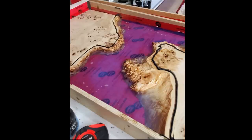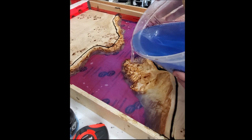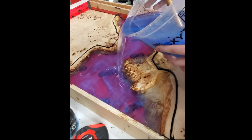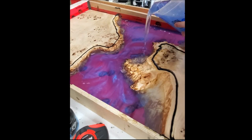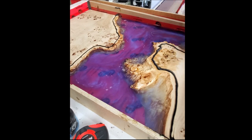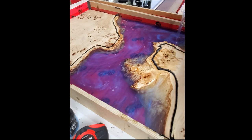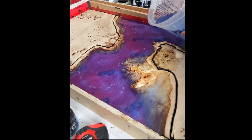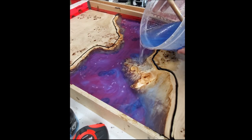The total volume of this pour was nine liters total — six liters in the beginning, and this is the second three liters going in right now, with another three after when the epoxy shrank a little bit and soaked into the wood. To stop that, just do it all in one pour — you can overfill it a little bit and as it shrinks it'll even out.